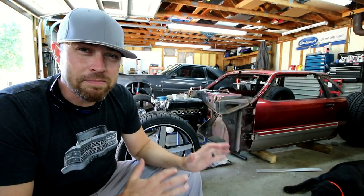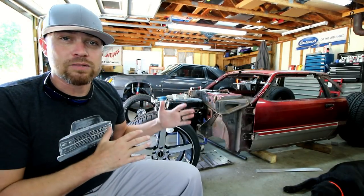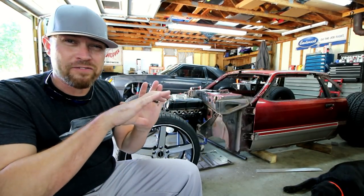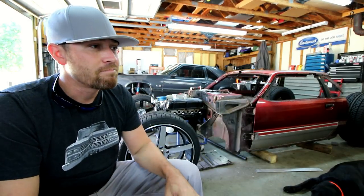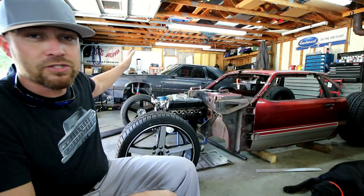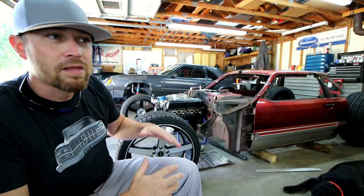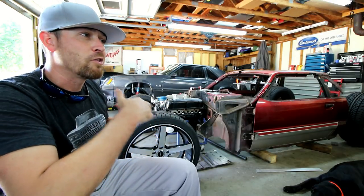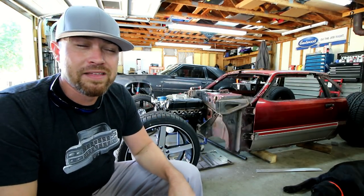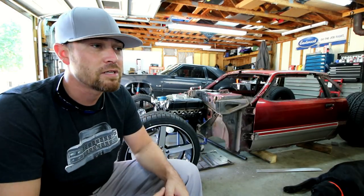I've had a lot of people skeptical about the aluminum exhaust, but it's actually used pretty widely in the racing world. As a matter of fact, they'll do aluminum straight from the turbos. The longevity may not last as long in the racing world, but the fact that I've got stainless running probably the first 4 feet and then turning into aluminum on the way out the back, I think it'll last a lot longer than most would think. I've actually done this on some previous turbo setups with no issues.